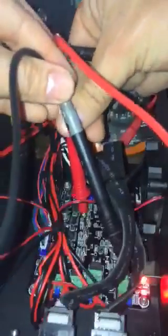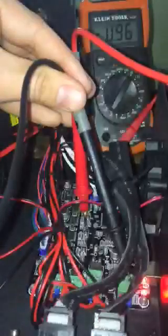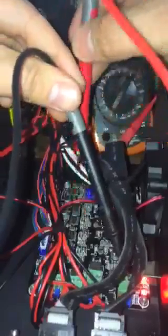Take your tool that comes with your Tevo Tornado — without shorting anything out — and move these ribbons out of the way. This is my first video and I'm learning; it's a lot of fun. When you turn these pots, you turn them counterclockwise to increase the current or voltage. We got 0.96 — we'll roll with that, it's pretty good.